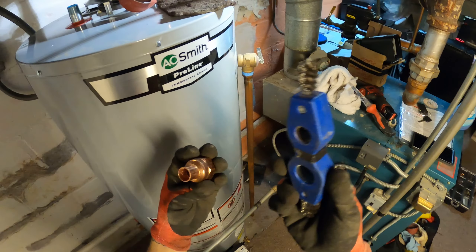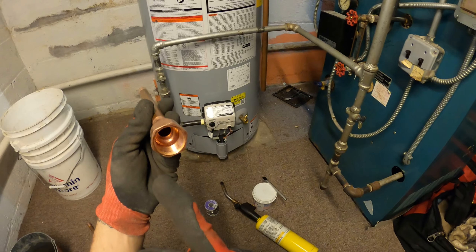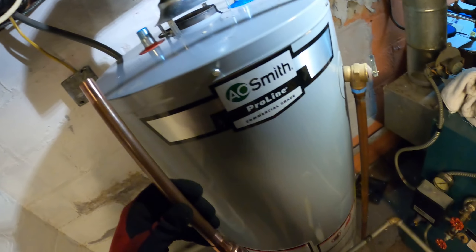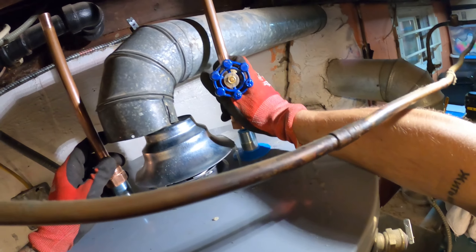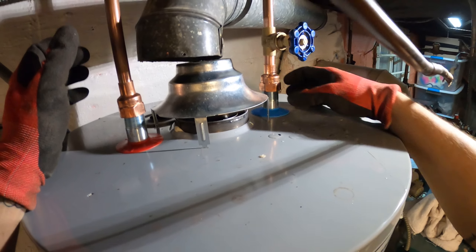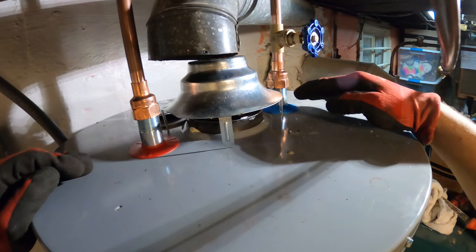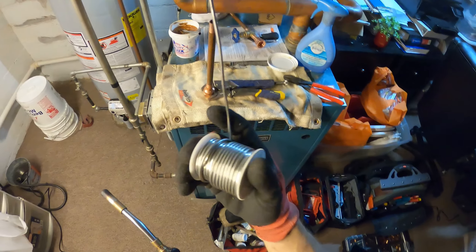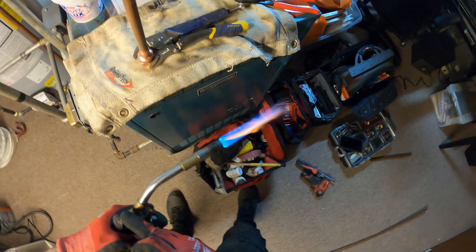When it comes to fittings and sanding, I definitely recommend getting one of these brushes. Everything's prepped. Since this is threaded, I don't want to solder this connection while there's Teflon on it, so I'm going to build up my pipes and solder up to this position, tighten it down, then make these connections up here so this Teflon doesn't melt. I got a fireproof mat here and I'm using lead-free 95.5 solder. Let's get started.